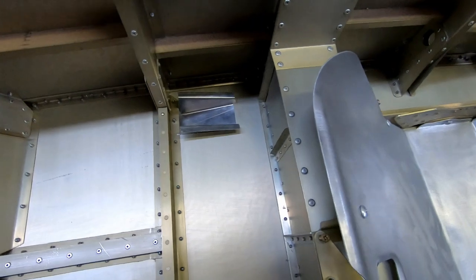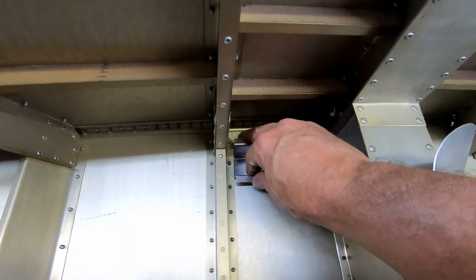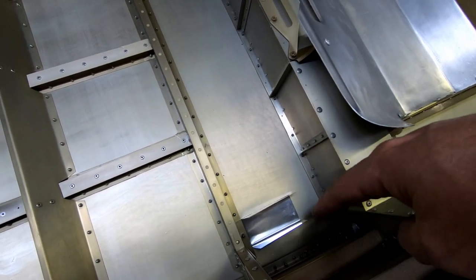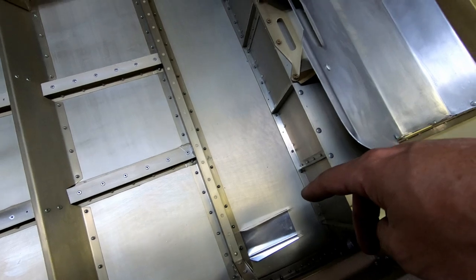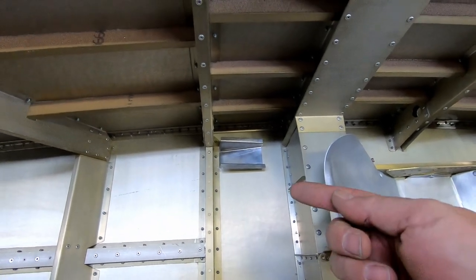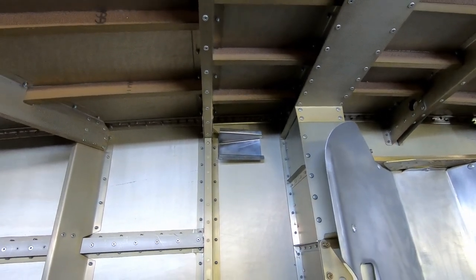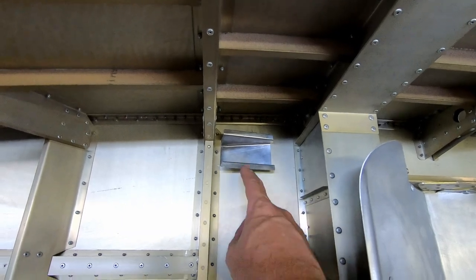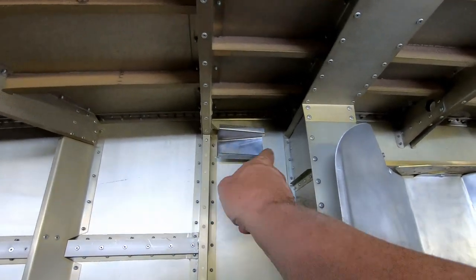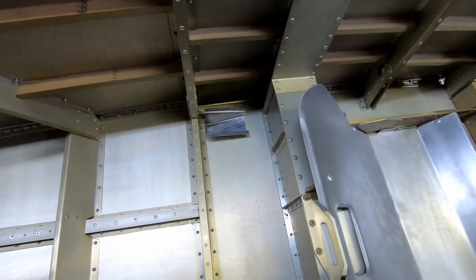The interior view now shows what the intake vent looks like. The 8-millimeter flanges are bent on one vent already. It's recommended not to bend those flanges until the pieces are actually fit into position. Using a bending brake didn't work because the opposing bends didn't have enough clearance in the small brake, so the flanges were bent by hand using a vise. One piece was damaged in the brake and had to be remade.